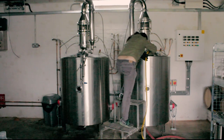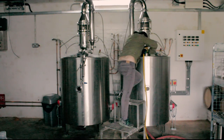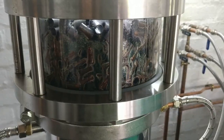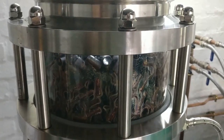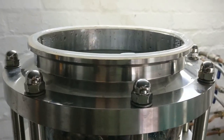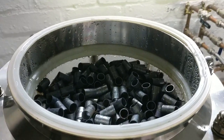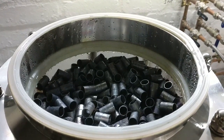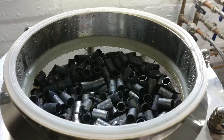I'm also getting a hose to spray out any solid material that might be left inside the still. Above the boiler of the still is a sight glass filled with copper packing material. We've cut these pieces from a 100% copper pipe fitting and as you can see the copper has taken on this gray-black color from reacting with the sulfur in the wash to produce copper sulfide.